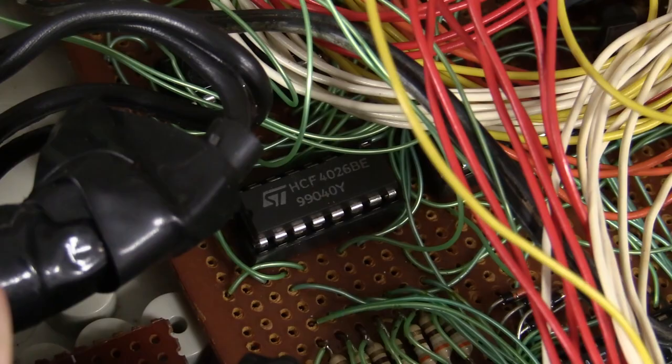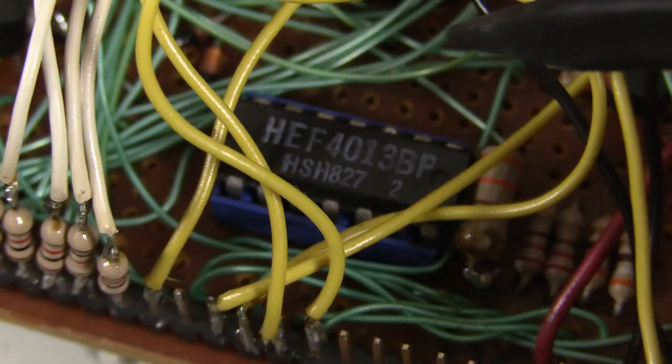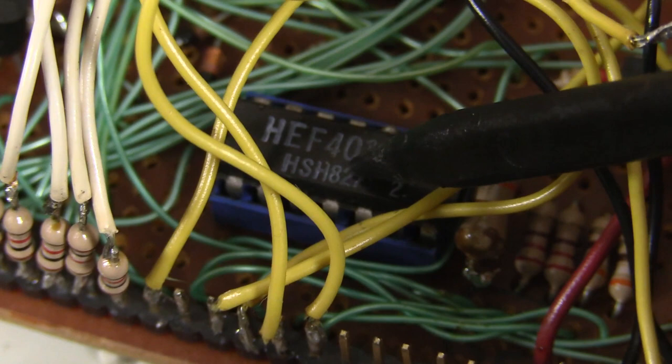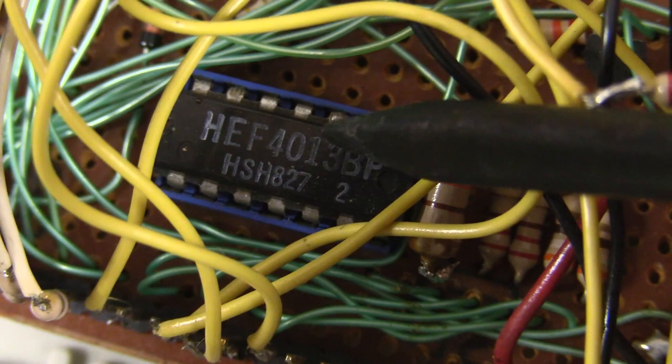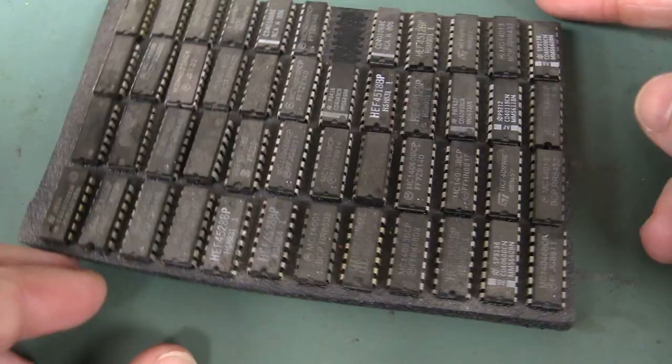You can see one of the replaced chips in here — CD4026s. I was very fond of 4026s back in the day, very handy little versatile chip. Used them in frequency counters and clocks and all sorts of stuff. That one's got a date code of 1999, so that was one of the chips I salvaged out and replaced at a later date — that's probably when I redrew the schematic. And there's a very sorry looking 4013, which I think has some solder on the pins — a desoldered chip from probably the early 80s.